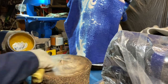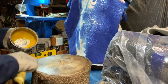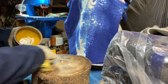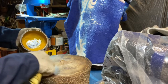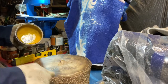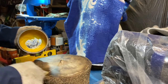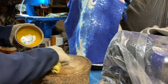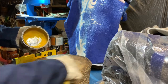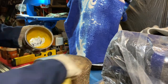Normally what I do is give it a coating, let it dry, polish it, and then give it another final coating. One of the good things about using the glue and sawdust mixture is that when you sand it down you're always going to get a little bit of glue remaining, but the mixture of sawdust and glue actually makes the glue porous. Otherwise it would literally just be a plastic finish that you can't put wax on, whereas adding the sawdust means the wax will actually absorb in and it almost makes it invisible.